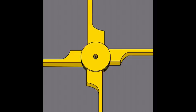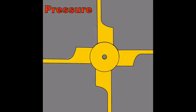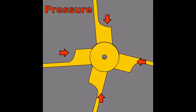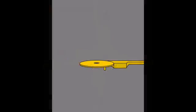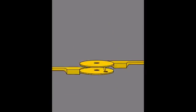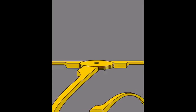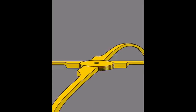The inward pressure caused by the weight of the arches would press each disc forward against the overlapping arm directly across from it, keeping them in place. In order to prevent the arms from torquing, I locked the discs in place by soldering a pin off-center on the first disc. This pin then fitted in corresponding holes in the 3 discs below, locking them at 90 degrees to each other.